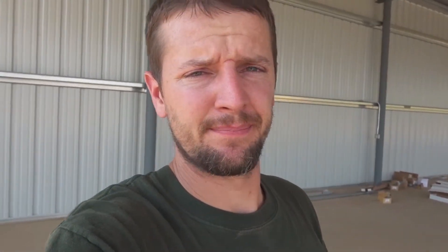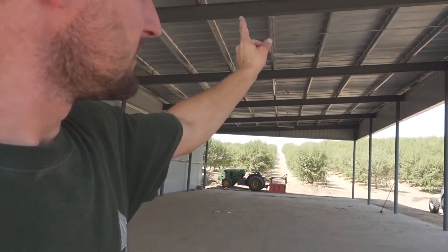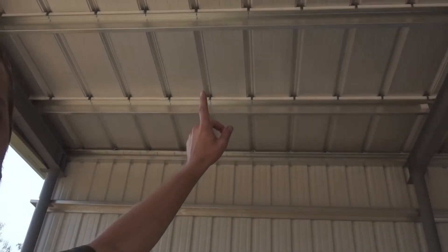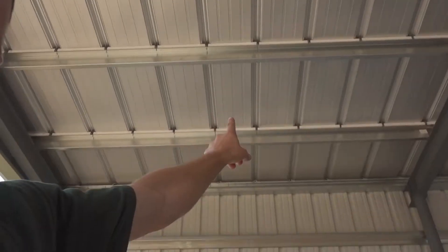We're back - it's the end of the day and we are wrapped up. Progress update: we have lights hanging in the ceiling now. We weren't able to get the wall packs in today, so my goal tomorrow is to get those hanging. The lights are hanging and we just need to get the whips connected into the box, then I'm going to finish the home run from this light right here down the wall and into the panel.